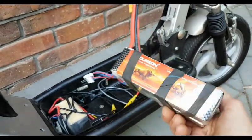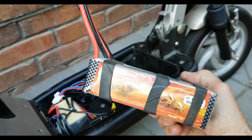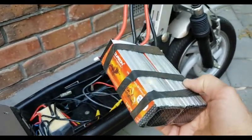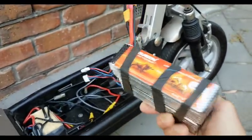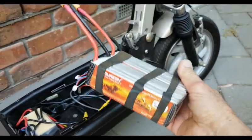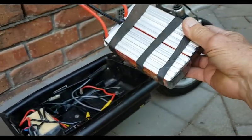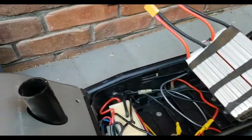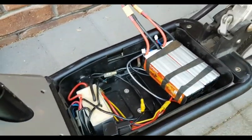So what I've done now is I've got hold of some lithium polymers. There they are. Now, these are 3S, 11.1-volt ones with 8-amp-hour capacity. So it's sort of about the same as the lead acids — lead acids were 9-amp capacity. This is about the size of one of the 12-volt lead acid batteries, in fact a little bit smaller. And so it kind of just sits in here like that. You can see tons of room left in it — you could fit another set in there.